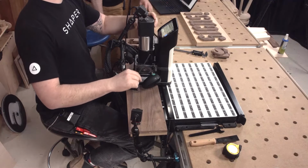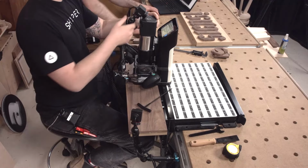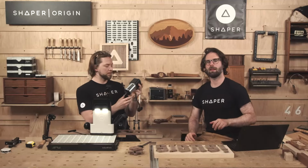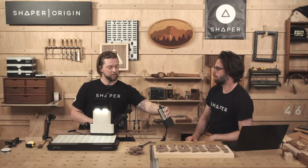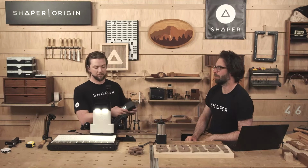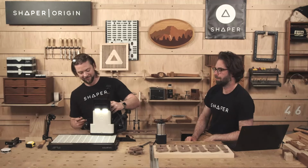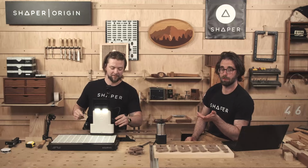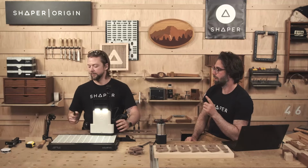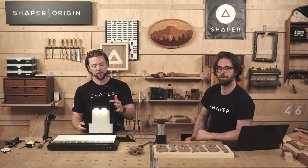We're starting with that 1/4-inch bit because that's going to let us helix these holes really easily. We're working with 3/8 inch dowel for this one, just because it's what we had. You could use a 1/4-inch dowel. I think we even have some 3/16 dowel. That was a special order. But the 1/4-inch bit will let us cut those 3/8 inch holes really quickly. For the rest of this letter, though, Jake, you're swapping out to something else.